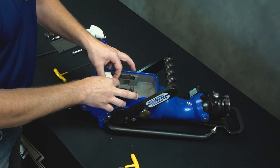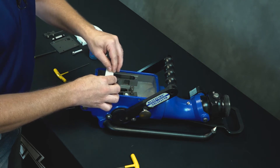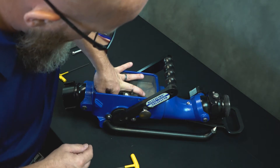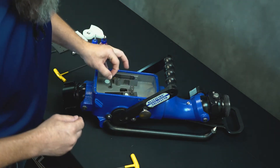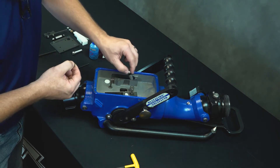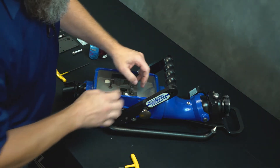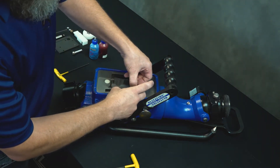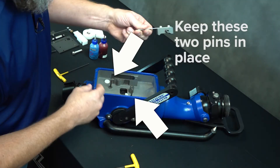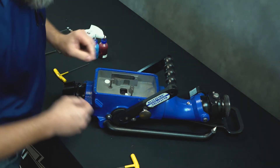Pull the trip block off. You'll notice there are two little Teflon washers on there — we're going to reinstall new washers that come in the kit. That pin came out; retrieve it from the bottom of the unit and set it aside for reuse. Remove the trip rod and ball — new items come in the kit, so we're going to replace those. You can lift off the leaf spring by holding that pin in place and lifting it up and off. The kit has a replacement, so set that aside for reuse later.